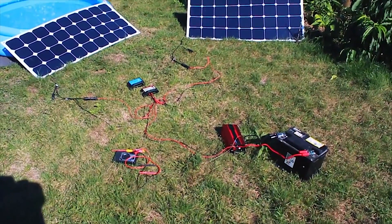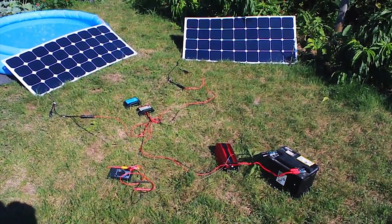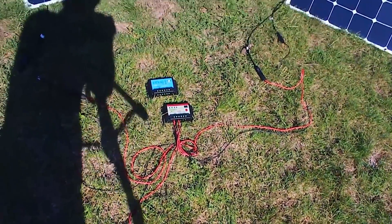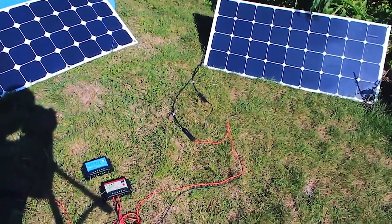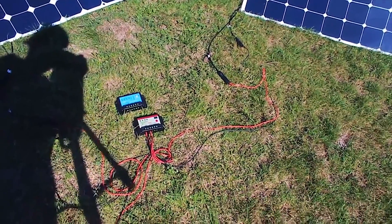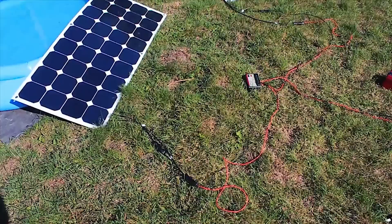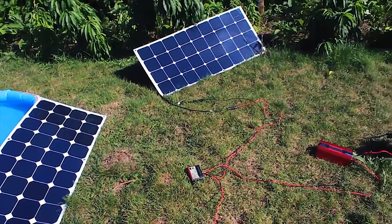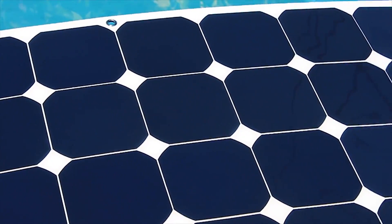A few words on correct placement of the solar panels. They need to be placed in wide clear areas and must face south for best efficiency. The preferred angle is 45 degrees based on the horizon. The setup can be modified and optimized, or we could even install an automatic rotation system so the panel can catch as much sun as possible throughout the day.